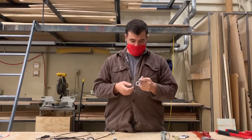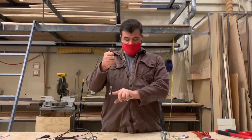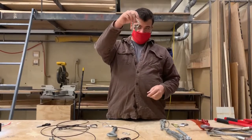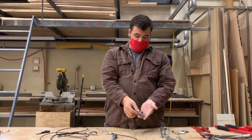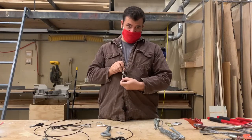One other thing when it comes to shackling: anytime you're doing any of this and it ends up being wrong — meaning it's not plumb, things aren't perfect, you're not bell-up or bell-down — it's called fouling. How that normally happens is when you first lift something, when it loses weight it's just hanging free, but when you add weight to it, it can start trying to lift at an angle. Always make sure things are used as they should be.